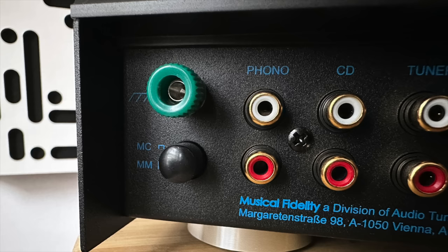One special mention about the phono input — the moving coil phono input is a current mode stage. Most phono preamps work on voltage, not current. This one works on current, and what that means is that if you use moving coil cartridges, you don't have to think about loading the cartridge at all. Just hook up the leads and you are good to go.